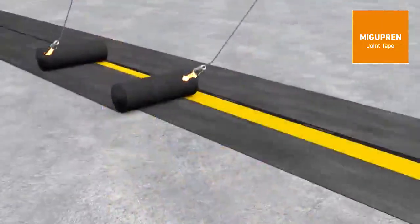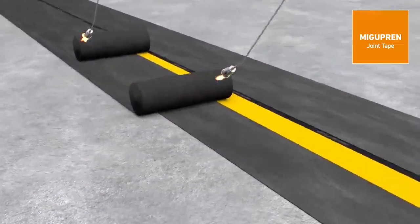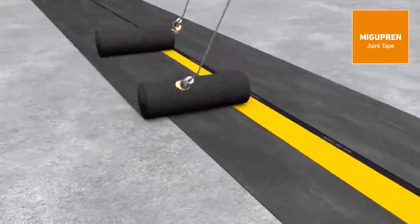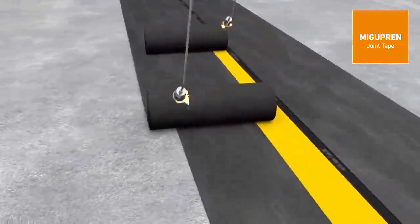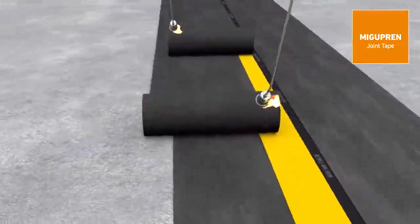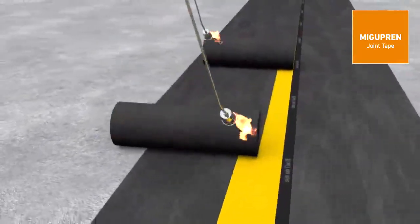In a 3-layer seal, at first the second layer is laid only to the middle of the adhesive flanges, and only then is the third layer laid and welded to the edge of the expansion zone. Again, the lateral adhesive flanges are sandwiched, involved in the bituminous seal.